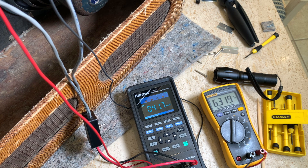Just check it every three to six months and you should be good to go. Always look out for red plating — you don't look at the back of your amp a lot. The drummer might tell you, 'hey, why are your tubes glowing?' Or like at one of my gigs, someone said 'what's that smell?' — and the amp had blown up. But that's a long story.